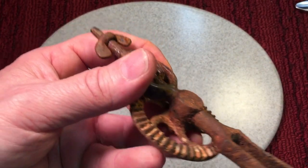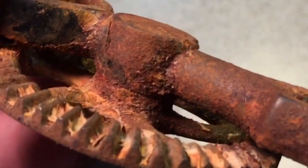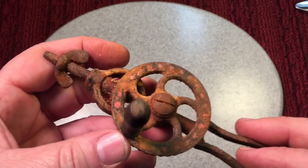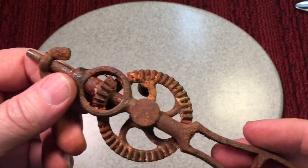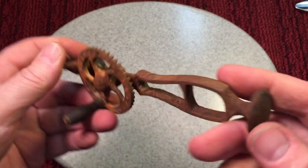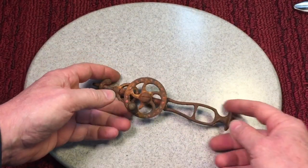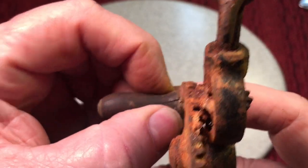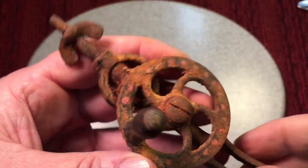What we're going to do — it's totally frozen. There are some teeth missing. We're going to try and make it operational if we can, but the first thing we're going to have to do is dump this whole thing in vinegar and leave it there for a while. One thing to notice: there is a crack here in the wood. Nothing we could do about that, just pointing it out — it was there before.